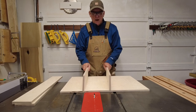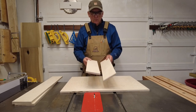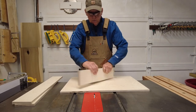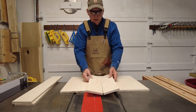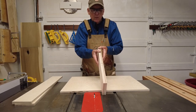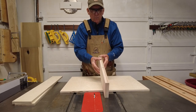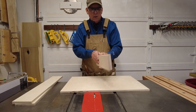Lengthwise for the sides I make them the full length — so if I want 18 and a half I cut them to 18 and a half. So here are my two sides, cut four and a quarter by 18 and a half, and I mark them with a triangle. The triangle is facing me. I look at what I want to be my show faces on the inside of the drawer, put those together, and mark it. The pointed ends point to the outside, the triangle is on the top, so I know what's on top, what's outside, and what's inside — and the direction too.